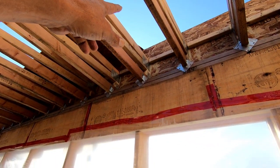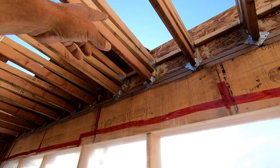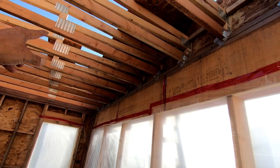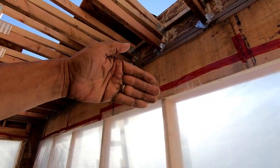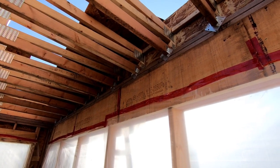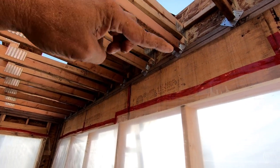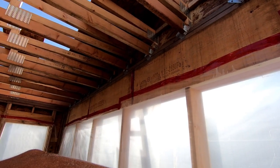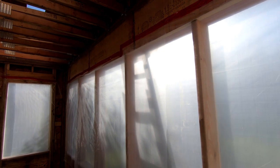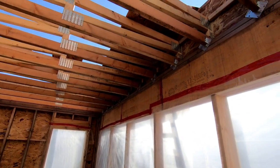And then, actually I got to cut the scupper holes before I put the rubber on, put the rubber roofing right over the scupper holes, then trim out the scupper hole. It's a rectangle. Push that flap down is what I'm going to do. They just cut it out completely in the video I saw.